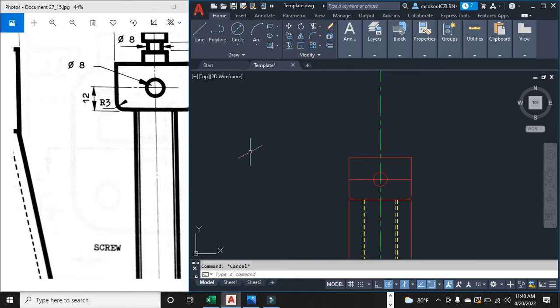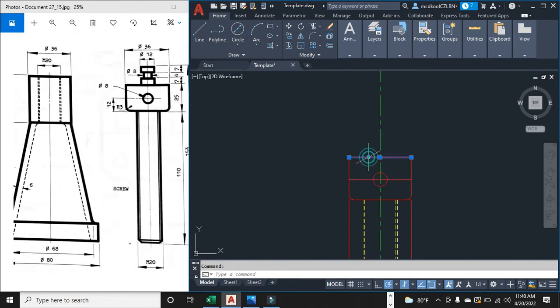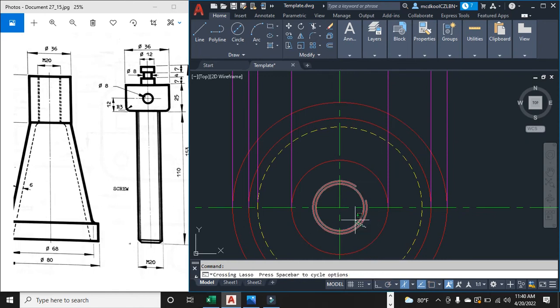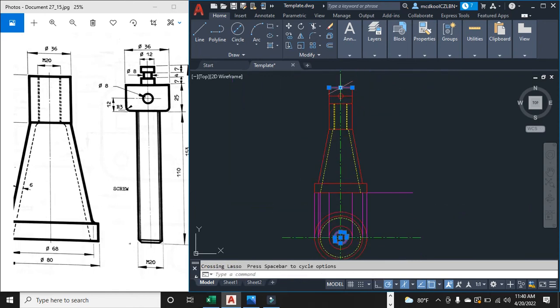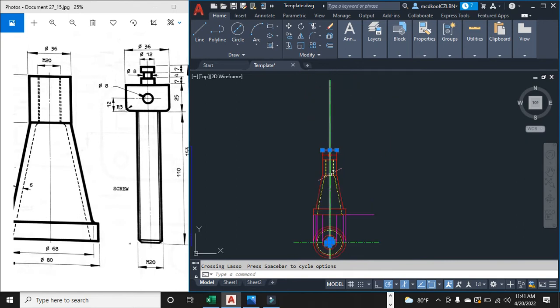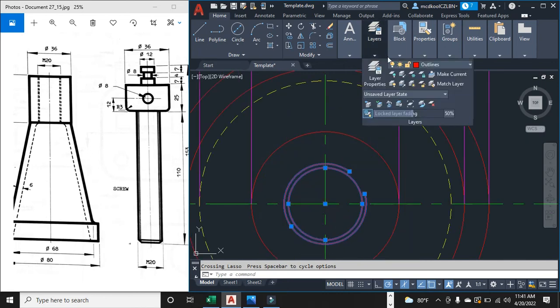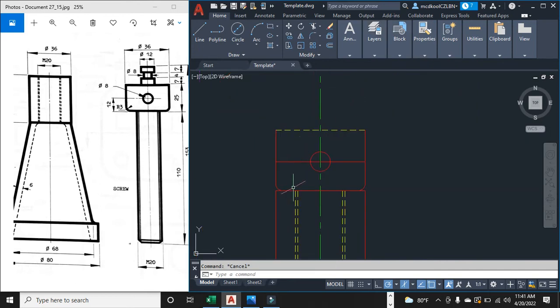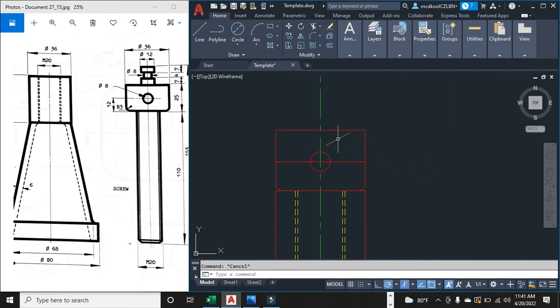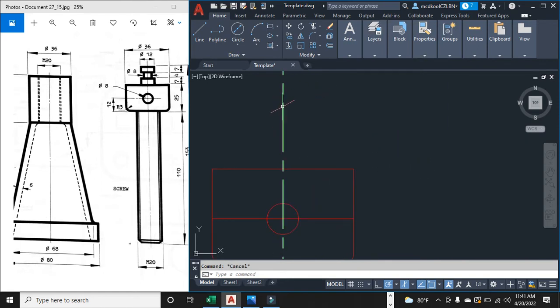Now the thing is that this piece here is solid. So we're going to see this piece here in the plan view as a solid piece. So what that means is that these holes here now are going to be hidden. Because when this piece here comes on top, we can't see these holes here. You follow me? Before, we could have seen these holes here because there was no part here. But now that the part is on the top, you can't see it. Very good. So I'll just put in this little piece here at the top now.